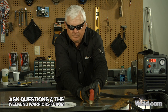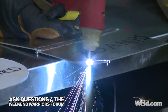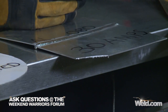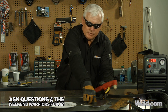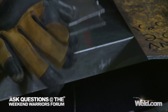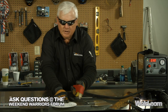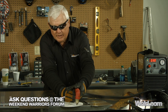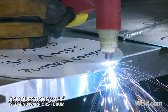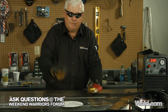Here's the clean aluminum. I'm grounding it. At 80 thousandths, there's not much drop-through, not much slag at all. Pretty good travel speed — you kind of have to control that travel speed. It's like TIG welding; you just got to get a nice smooth rhythm going. As long as I get contact on the bottom of this, it will cut right through powder coating. I'm holding it with hand pressure contact. There we go — I just cut a chunk out of it. Smells kind of funny, but it cuts just fine.